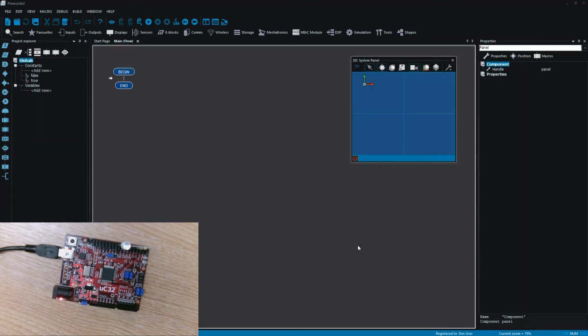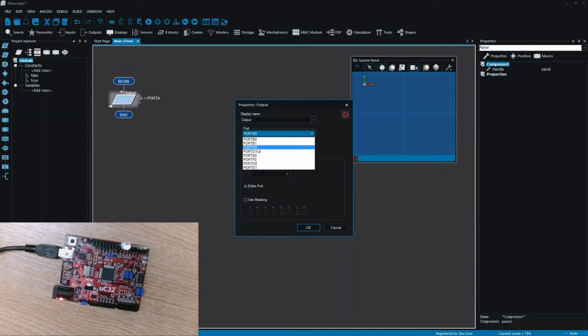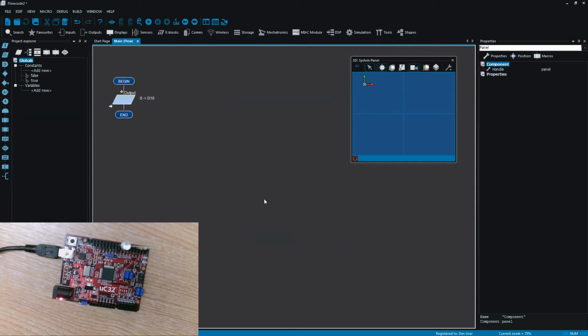Now you might be able to see on the video we've got an LED and a resistor, and that's just connected between pins D0 and D10. D0 is the anode, D10 is the cathode. So what I'm going to do is add an output icon. I'm going to set it to single pin mode to D10. I'm going to output a 0, and that just basically provides the ground for the LED to sink the current. So we could use this as a global enable if we wanted to be able to kill the LED or bring it on and not affect the PWM